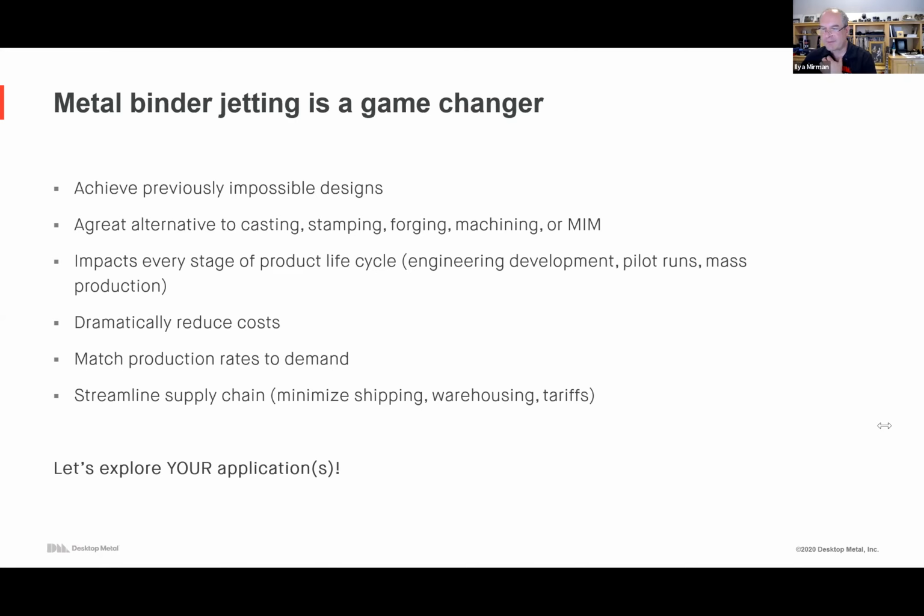If we could sample pieces, do you have electroplating capabilities? Do we need to go to a third party for plating? One way or another, it's pretty straightforward to plate parts. Our headquarters is in Burlington, Massachusetts. I've used a plater for the last 25 years that's 7 minutes away. So you have to be careful about the process. Do they have certification and process controls? But it's basically trivial. All of these we've done, or our customers have done. You do a nickel strike on the steel just for adhesion, and then put anything over it you want, whether it's copper plating, nickel, chrome, black nickel, gold, silver plating, etc.